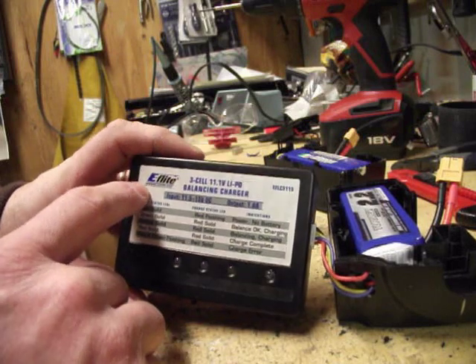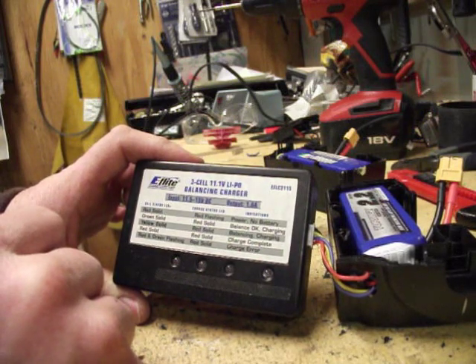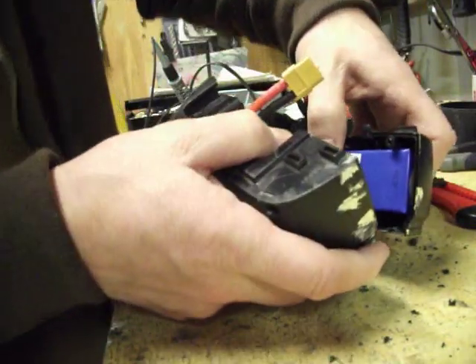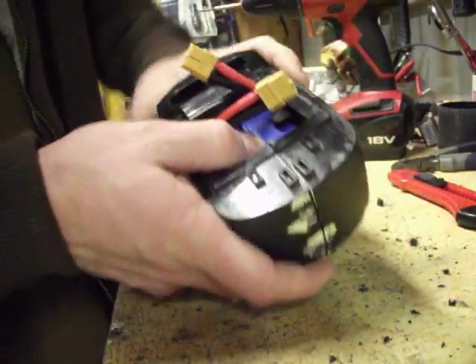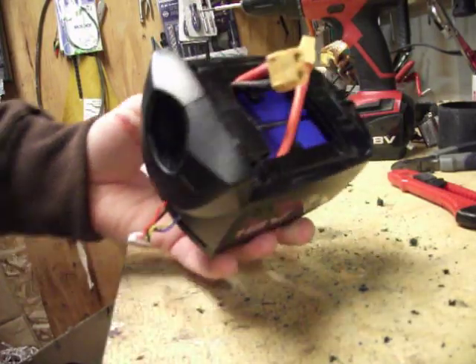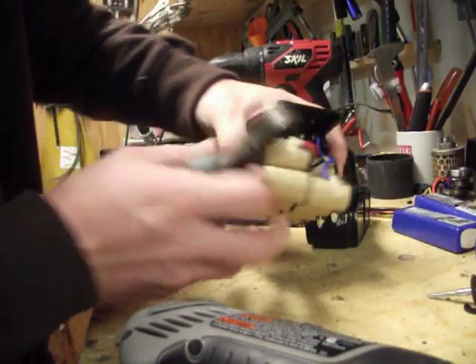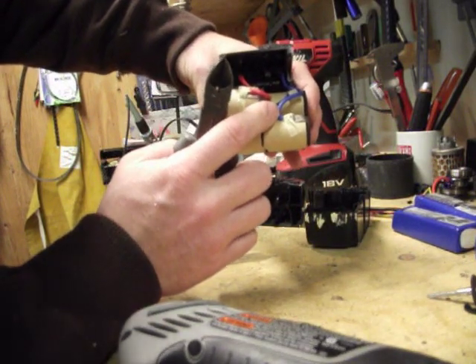You can find it on eBay cheap, or I'll show you the website I got these batteries from. So it's working pretty good. I can see the plus sign up here — red was positive, blue was negative. So let's cut those off, leaving them long enough so I can work with them. This little thing was a temperature sensor on the pack so the charger could know if the pack was overheated. I'll leave it on there but I'll probably never use it.